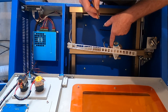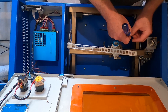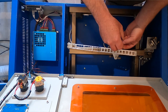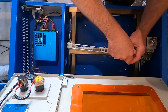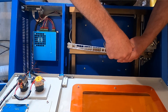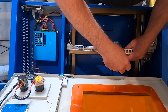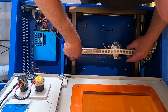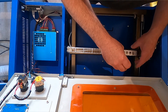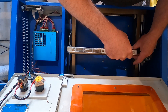Before you do this, it's a good idea to tighten this screw or make sure it's tight. As long as you're not really rough with this, you'll find that you're probably not going to lose your laser alignment. If you do, it will only be a slight amount. So I'm just going to make sure my drag chain is straight and tighten these screws down.